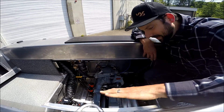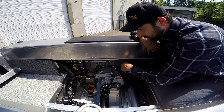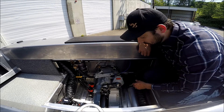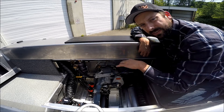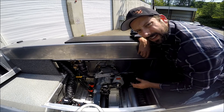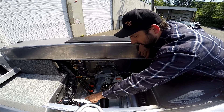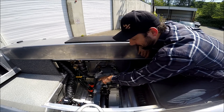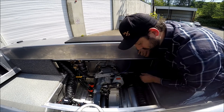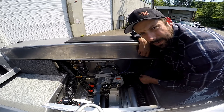Here we are behind the engine cover. Between the engine cover and the transom I've removed the floorboard — just a quick removal — along with the transom board and side ones, so you can get to everything back here. We're looking at the front end of the Hamilton 213 jet, very similar to the 212 except the 213 has hydraulics to shift the bucket up and down under pressure of water. You can see the drive shaft. All Hamiltons have two bolts — remove a cap and get a clean-out right at the drive shaft if something gets wedged. Got a sand trap, a wash down pump, a couple of bilge pumps and a float switch, a seacock going to the wash down pump for extra safety, and blower hoses with a couple of blowers down in there.